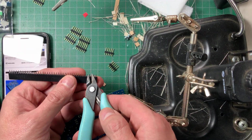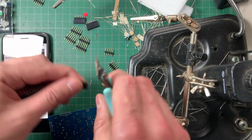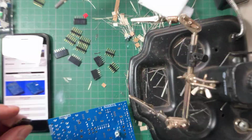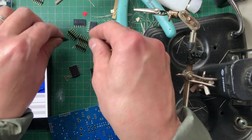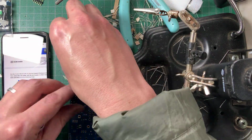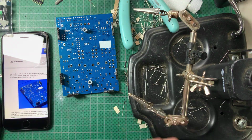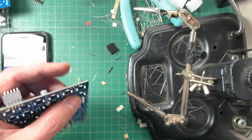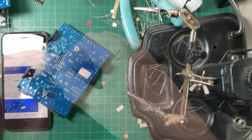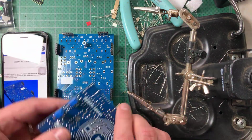To cut the pin sockets, you will always lose one slot with each cut, so cut right at the center of the slot after the number you need. Then trim off the excess plastic. Now snap each pair of sockets and headers together. And start plugging them into the board, following the manual carefully. Then solder one pin for each header while adjusting with your finger until they are perfectly straight. Now plug in the other board and solder the sockets.